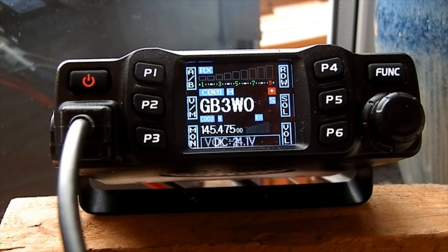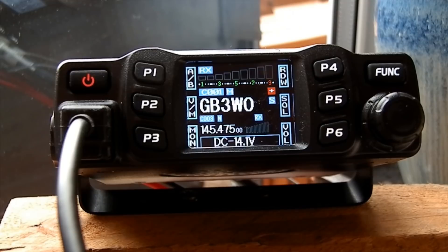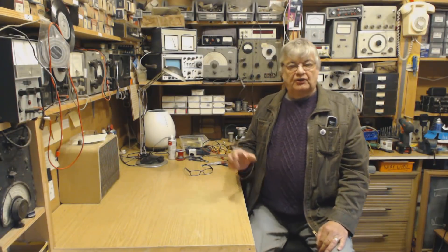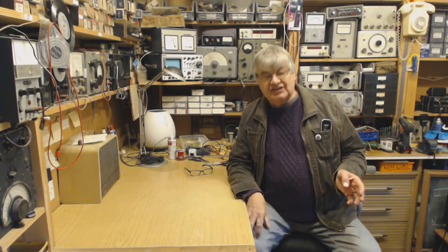What is the power on the transmitter? You've got power levels: 5, 15, and 25 watts, which is useful. I keep it mainly on five watts — I don't do any long distance DX stuff. It does get very warm if you're going to use it on high power for a long time. The case does get very warm — it's die cast alloy or something. The whole cabinet of the thing is a heat sink and it does get very warm.